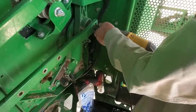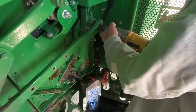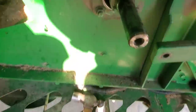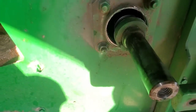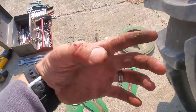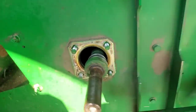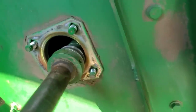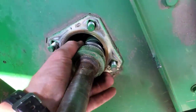Look at this — it's got a cord; it doesn't have enough to go. Getting down a little closer. There's a locking collar on this bearing — I've got to get an Allen wrench and take the set screw out, and then it gets a little more complicated. Did you get a picture of your bloody knuckle too? Oh yeah, it happened. Well, I've got half this flange off that holds the bearing. The problem is if I lose one of these bolts it falls in, which makes this a lot harder. So we're going to get some wire and wrap around them to try and hold them in place. Then we've got to get this inner race off, which is also going to be tricky.